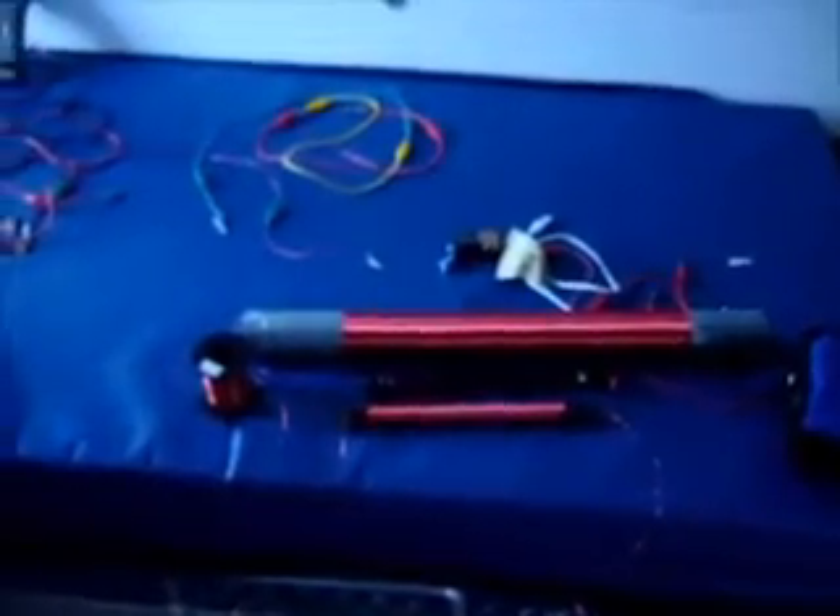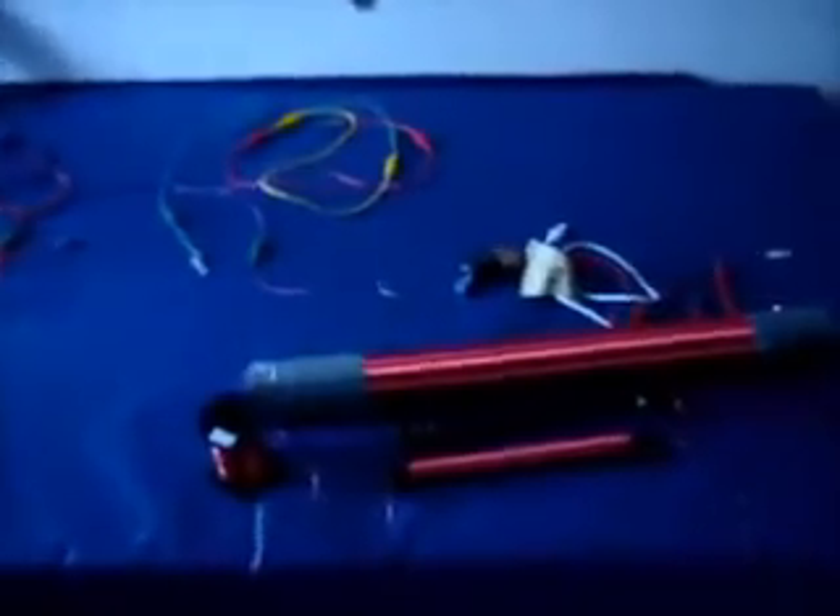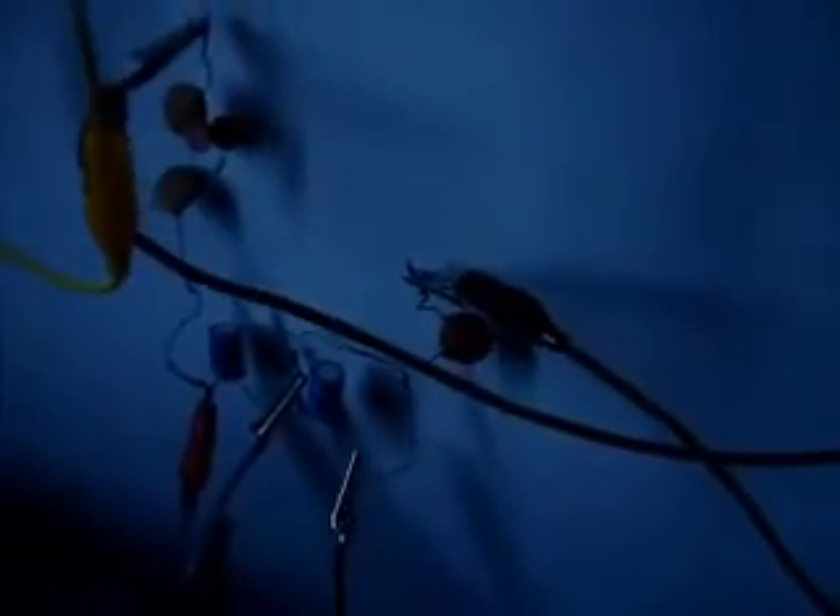In the next few days I'm going to start adding what I had added before and tuning it. Here are a couple of my transformer slash resonant rods — some are single-wound, some are bifilar, some have ferrite and some don't, and I'll start adding those. This circuit is a little bit different; I've changed it a bit — I've removed one of the disc capacitors from the top and it seems to be working a little bit better.